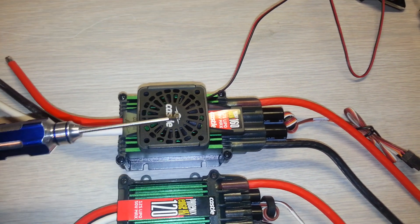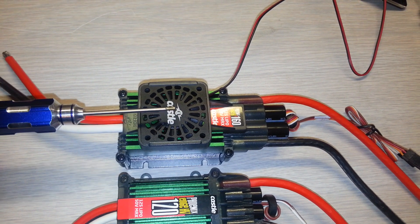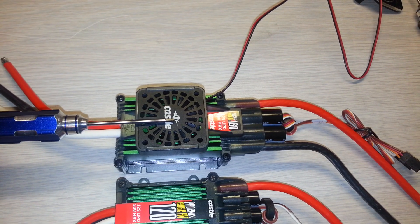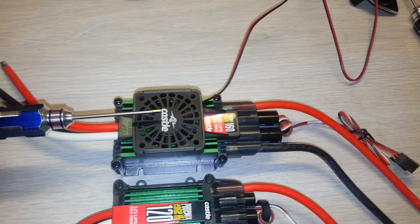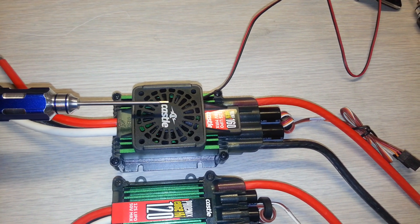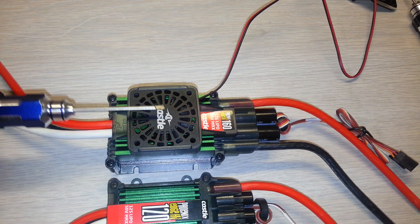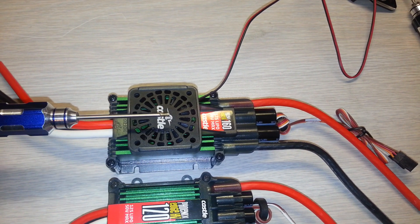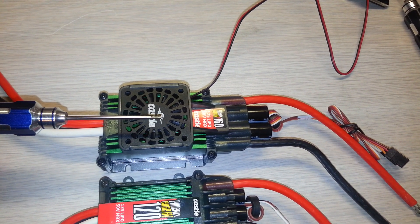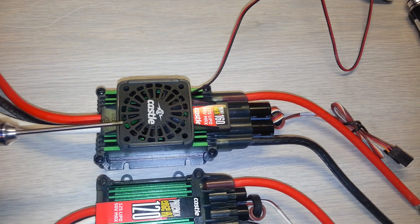The 160 with the fan is a little bigger than the 160 without — some of the casing is cut away on the fanless version so it's more curved, while the fan version is more flat on top so the fan can lay flat on it. I'm going to be running this off my two-cell LiPo pack at about 7 volts. They say 5 volts is best for the fan, but running at 7 volts might just reduce the fan's life a little bit.